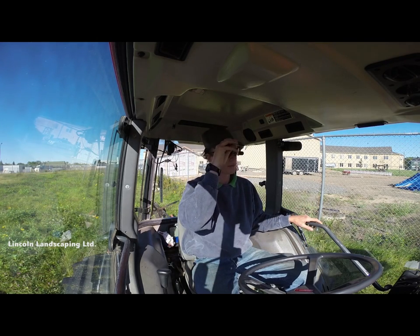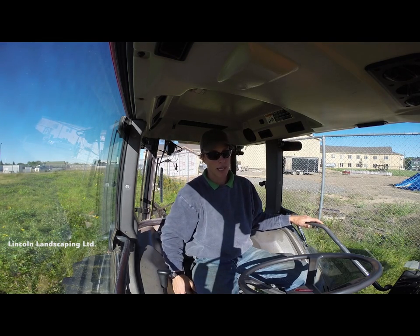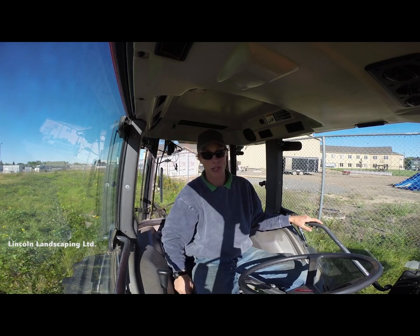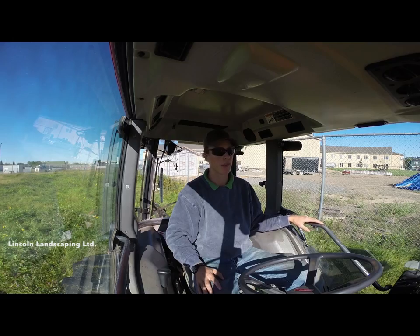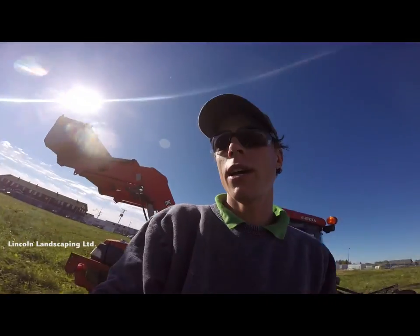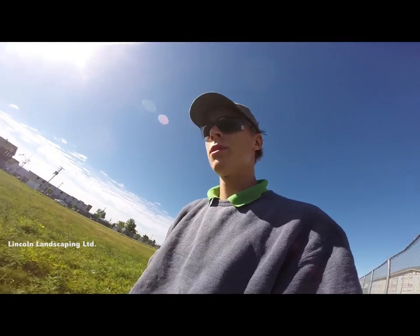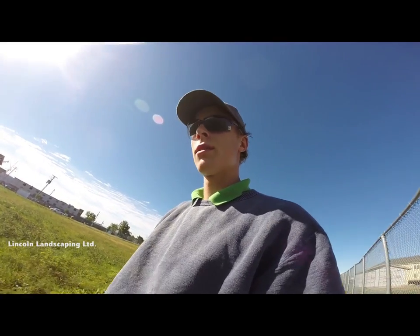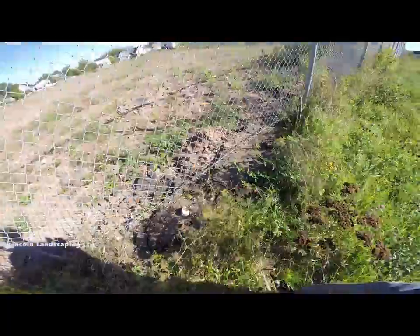Oh man. Lifted up the deck too. You gotta be careful when you get under the deck or the bucket, because you can't trust the hydraulics. They'll just drop on you, so you gotta be really careful. Two close calls already. I don't wanna go by a third and miss something else, so I'm gonna walk the property again, because clearly this morning I didn't do a good enough job.